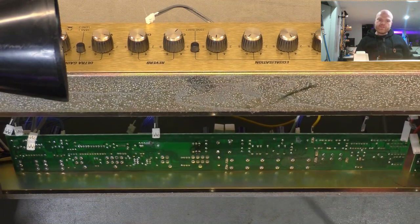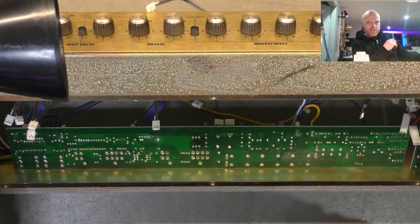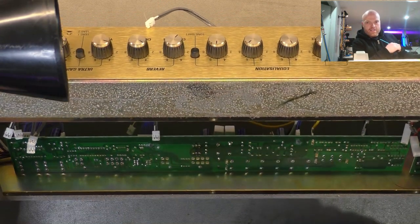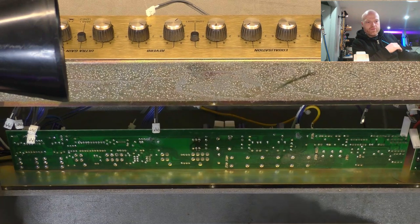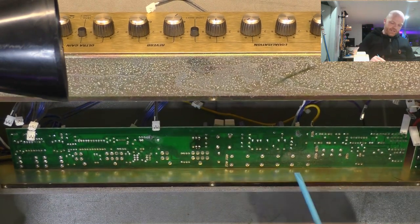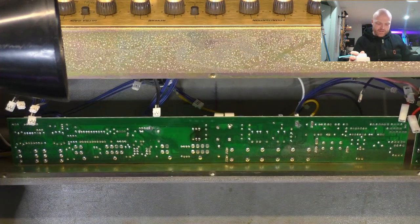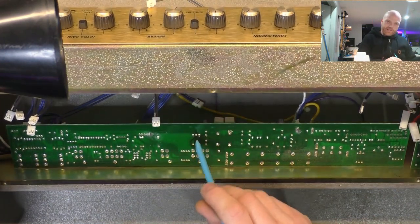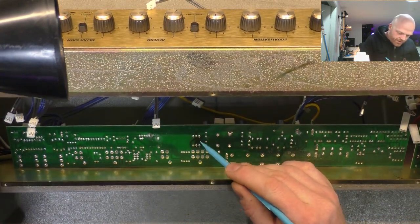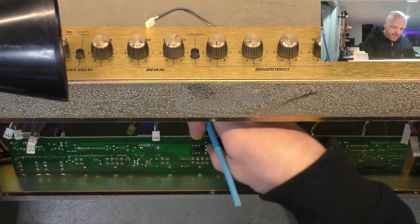Surprisingly low voltage. If you've ever seen Louis Rossmann's channel with MacBook repairs, you're talking 3.3 volts. And serious shit goes down with a little bit of moisture and some contamination at 3.3 volts. So there's some heat damage here and some dry solder joints there from them melting their own connections. So I'll look at what they are on the other side.